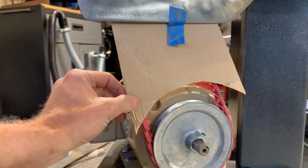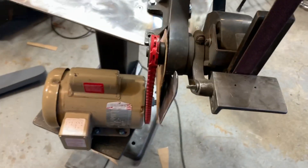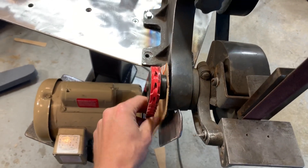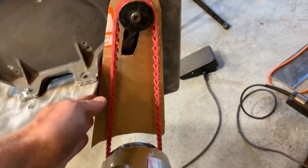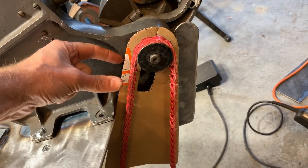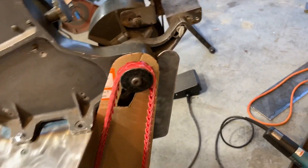This one comes down just below the motor. These two may attach to each other, so the motor and belt are enclosed from this side and especially from the working end up here, because this is the thing spinning. Those are good belts, but if that thing decided to catch and let loose, it would not be good flying up toward me. So I did get a piece of real flexible steel — it's still a little rusty, but definitely thick enough to contain a belt if it decides to fly apart. I'll use this template, cut out a nice piece of metal, and then bend that piece to fit right over here. I'll tack weld on some little tabs here and here, and that should hold it.